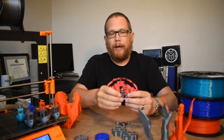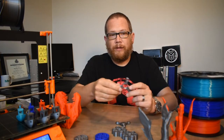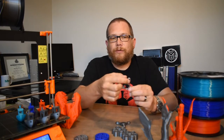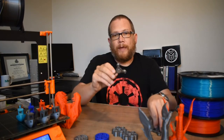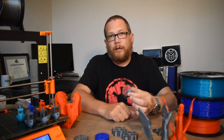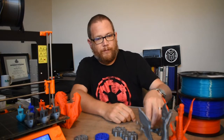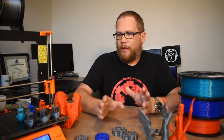Before all these Benchies, my CAD tutorial was making a fidget spinner, so I went ahead and printed it. The first one I did had the bearing hole a little too tight, and the holes for the steel balls were a little too tight too, so I bumped the tolerances up in my CAD model, reprinted it, made some caps for it, and now we have a fidget spinner that works. I also printed some for friends and family.